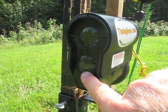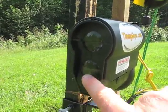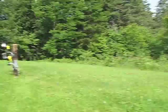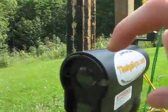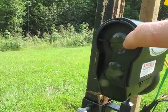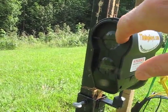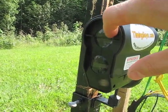I think this is the transmitter. So in the setup that I have right now, this lens is transmitting light out to my reflector. And then the light is coming from the reflector back and is coming into the top lens. And so in the top lens, we have a detector. So light leaves the apparatus through that lens, and then light comes back in to the apparatus through that lens.